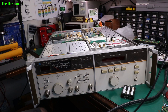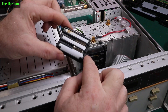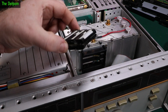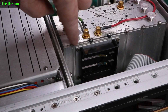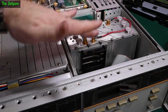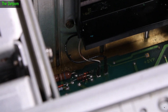Let me show you the battery pack location — there's the holder and as you can see it's a bit corroded in there. I'm not sure what the battery pack is for — probably some memory system. It's got some metal strips for connections which really look bad. These look like NiCADs. I might look at what I can do with this — maybe pull the thing apart and check the diagrams. Even the screws holding the casing have corrosion from proximity. It's got a couple of wires going to the circuit board, so I could take the holder out and replace the pack, connecting straight to the board with a couple of pins.